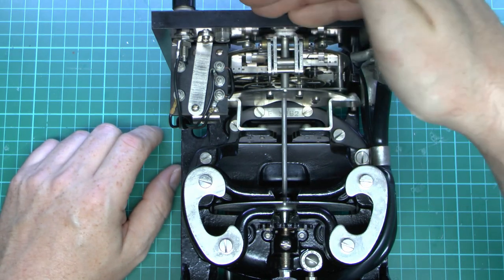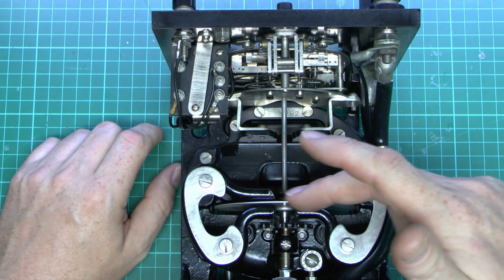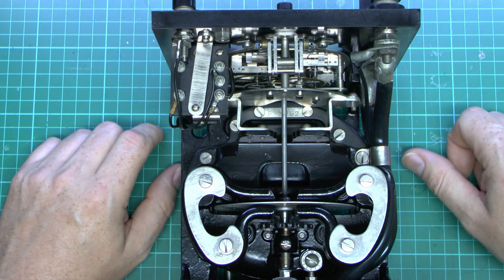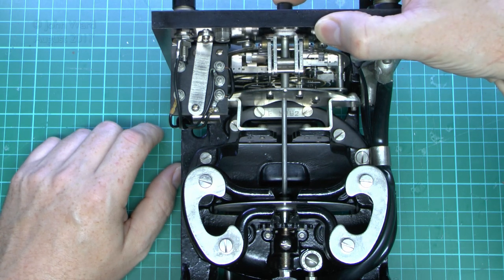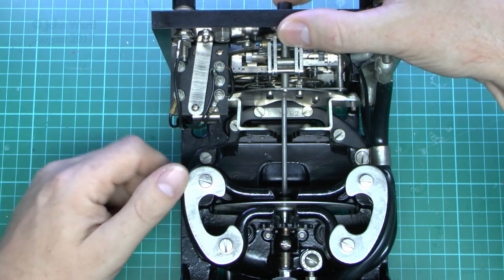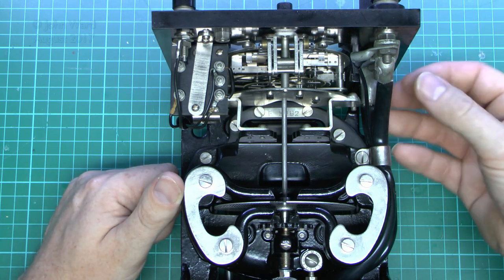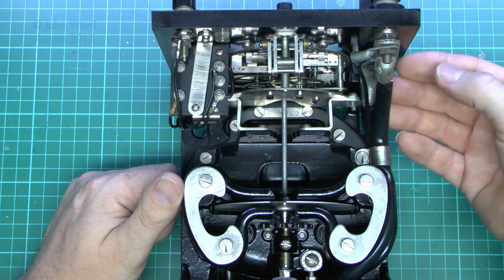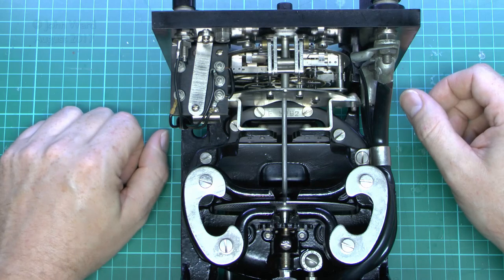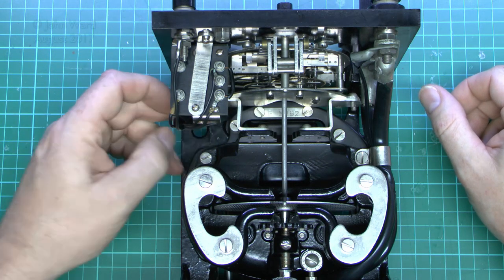So this is inside the upper half here. This top piece just essentially looks to be just like a normal electricity meter. We've got the rotating disc here, and there's the spindle that goes straight through to the pointer on the top. We've got the various gears on the top which operate the pointers, and the buttons come through on this mechanism here, which actually just resets that to the zero position. On the side here you've just got the wires coming to the terminals on the top. These on this side are considerably large — these are the ones marked current, so you'd expect them to be the larger size. And then the potential or voltage ones have very thin wires, which is pretty much what you'd expect, because current needs large wires while voltage only needs very thin wires — it's only a potential difference between the two terminals.